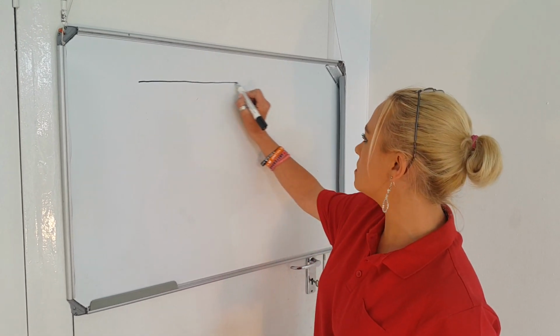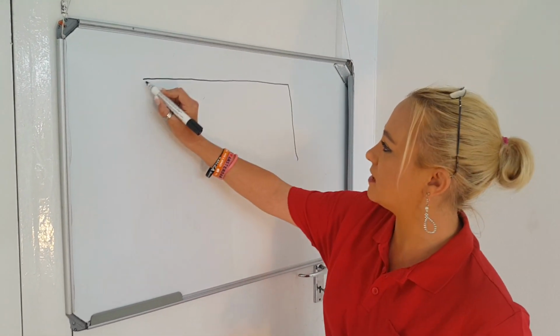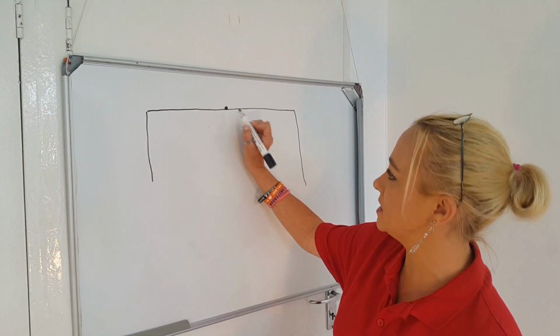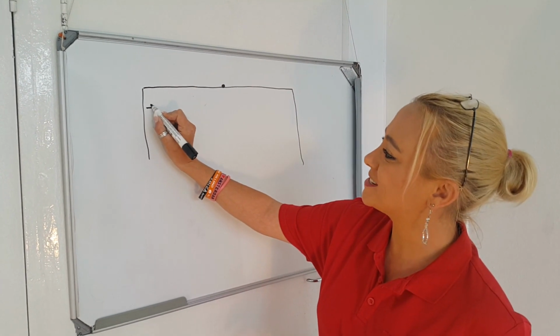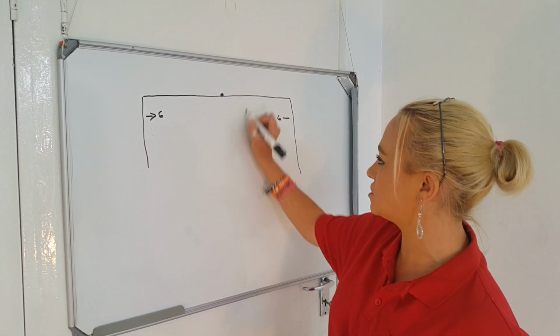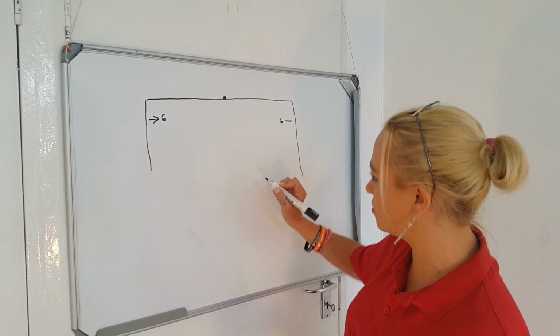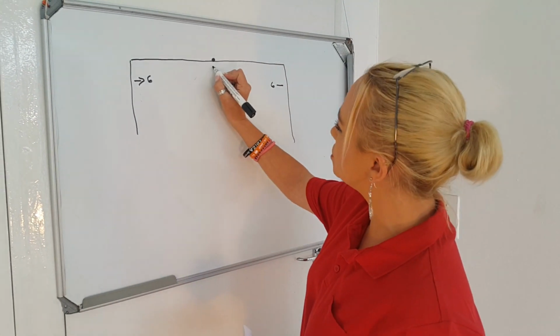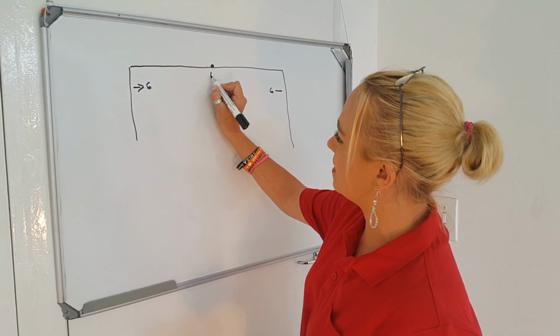Here you will have your wall, okay, just to give you an indication. That is going to be then where my thermostat point is. You always want to start 600 roughly away from the walls. Okay, so 600, 600, all the way around the room. So 600 from each wall. Right, what I have figured out, I'm going to start laying my heating here.